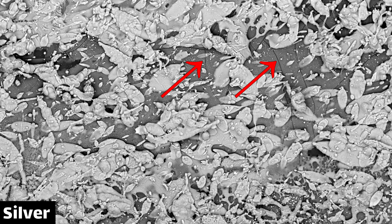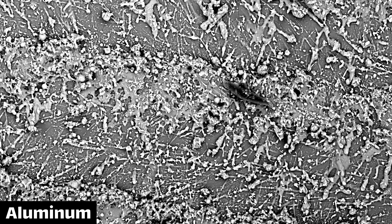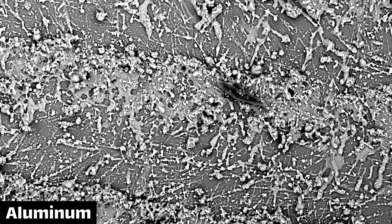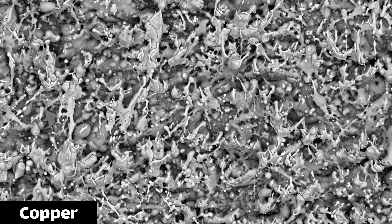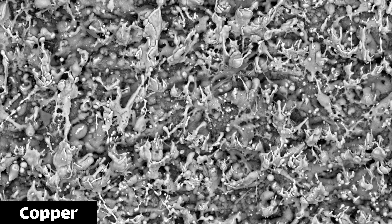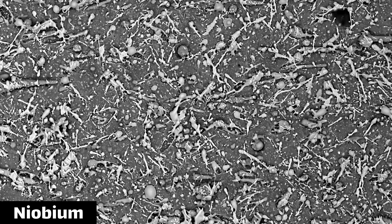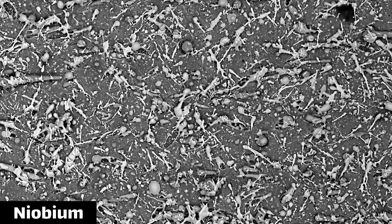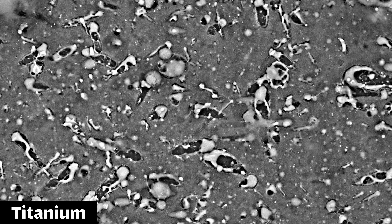Instead, this is very obviously molten droplets impacting the glass surface and solidifying quickly to form a metal film. We can also see small microcracks in the glass slide underneath the metal droplets, which confirms that it's a hot molten metal process. All of the other metals are essentially the same, just with different amounts of splashing and morphology — the shapes and sizes of the droplets vary depending on the metal, which you'd expect based on different melting points.